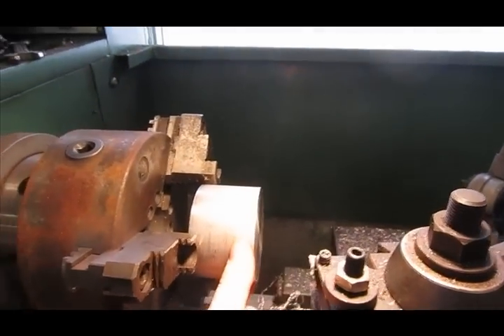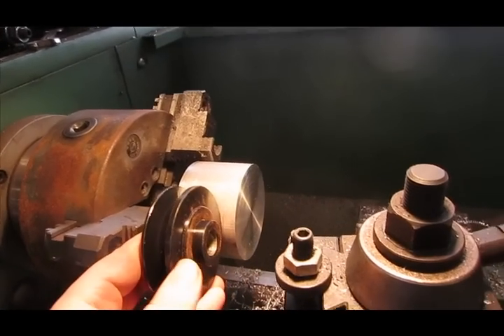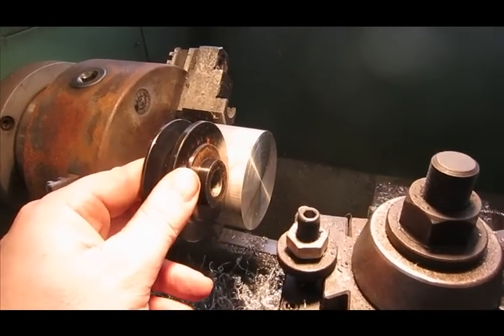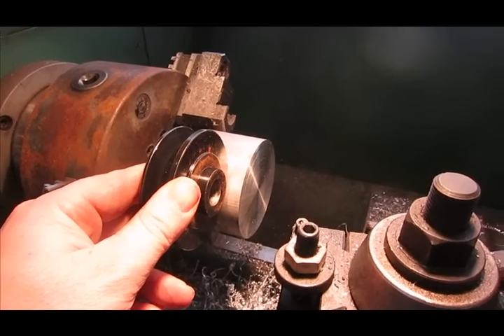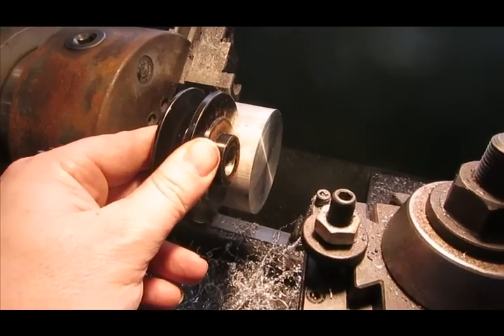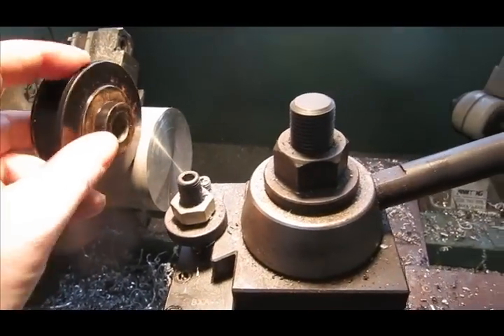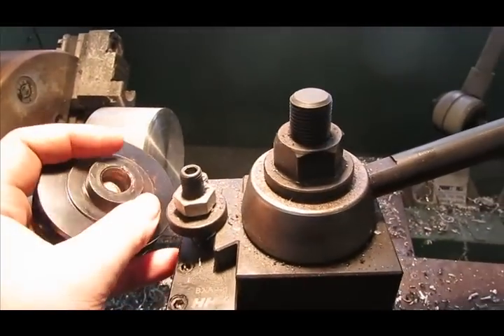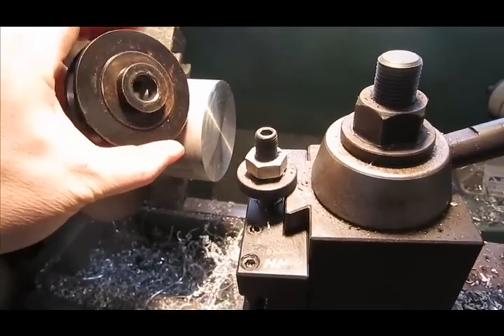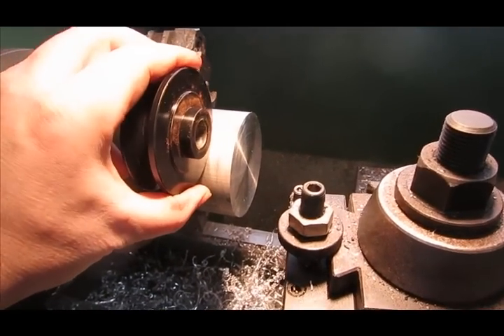The next thing we're going to do is start turning a strip of the outside down to diameter. We're going to be making this pulley in this direction. I try to do as many operations per setup as possible, because once you start machining, you're creating a part that is completely cylindrical around the axis of rotation. As soon as you un-chuck it and try to remount it, it's not going to be as concentric as it was — it'll always have some little variations. So to make the best quality part you want to do as many operations as you can. I'm going to use a caliper to figure out the depth and diameter, and also use the tool bit to touch it in place to make a little score line so I can visually see where those spots are.